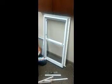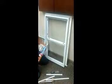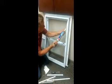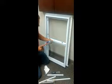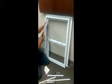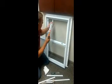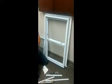Next you're going to silicone all the way around. Using 100% clear silicone, you're going to put a small bead of silicone all the way around the opening. Just remember to make sure those setting blocks stay in there because that glass has got to sit on the setting blocks. So we're going to take a little bit of silicone — I'm doing a real small bead here. I've got all the silicone on there.